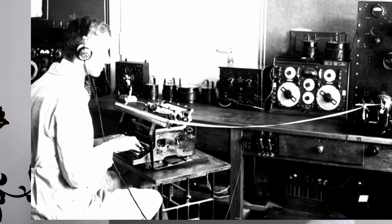I think there are two reasons it's fascinating: it's a challenge, and it's historic. It's also one of the best ways to communicate. With a 100-watt HF transceiver sending CW, you're generating the full 100 watts. Compare that with SSB, where the average power carries the information — and the average power of a 100-watt SSB transmitter is maybe 50 watts or a bit less — so you're only getting around 40 to 50 watts of signal carrying the relevant information. CW has roughly a 3dB advantage.